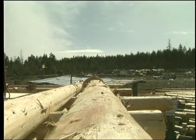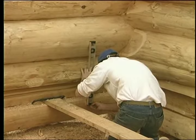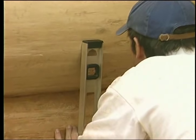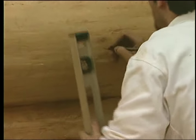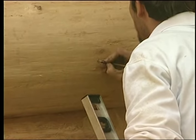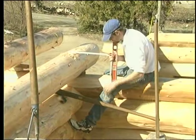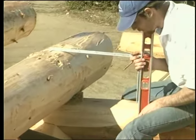Check the location of the center line on the top of the plate log and square the building. If reference marks were placed on the bottom log at the time the building was started, these marks can be extended to the top log and an accurate location found.